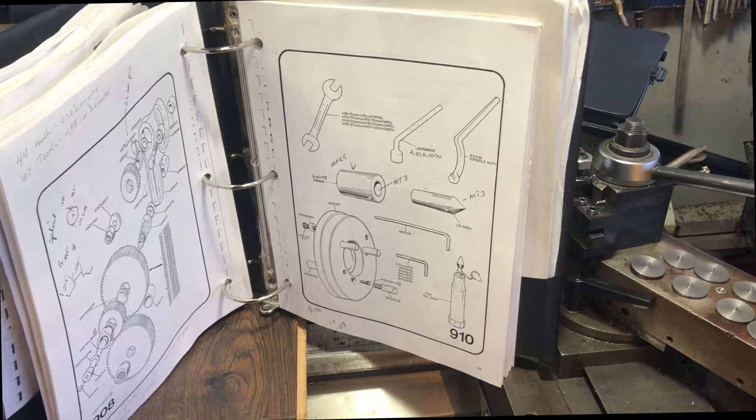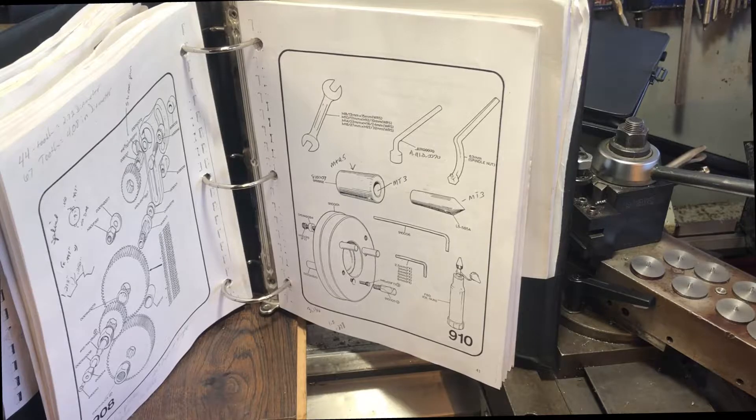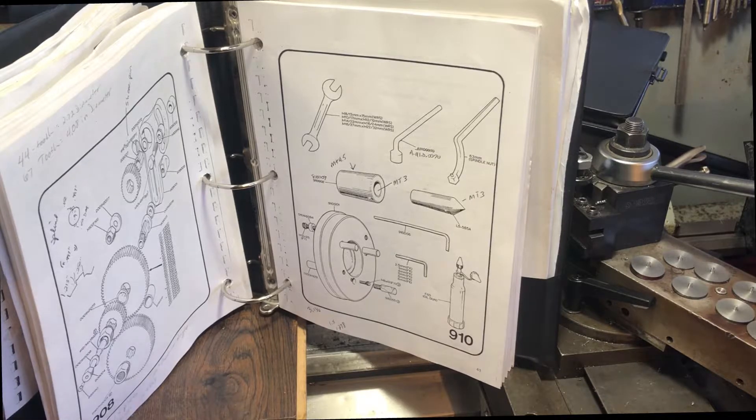This is for a Clausing 11 slash Harrison M250. The Morse taper goes into the spindle — Morse taper 4.5 — it's a bit of an oddball, but not that much when you start digging in. The inside taper is Morse taper number 3. This lathe was made in England and I'm in Michigan, America. These adapters are extraordinarily rare. It shipped with one, I'm pretty sure, but it's long gone. So if I want to turn between centers, that's a problem. I can chuck something up with a 60-degree point, or I can try to do it properly. Let's find out.